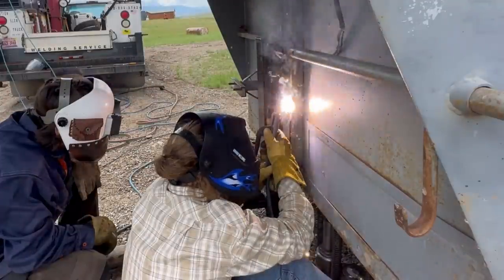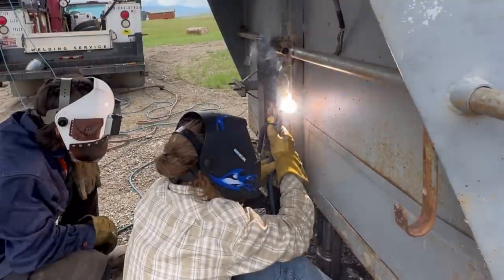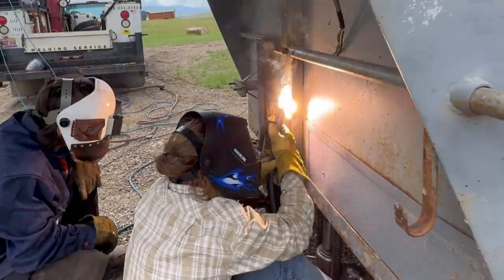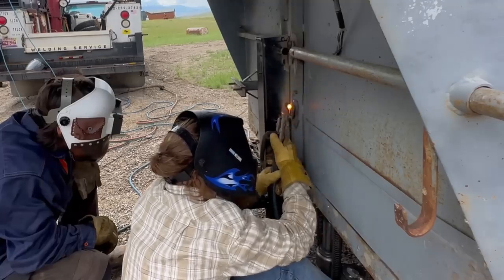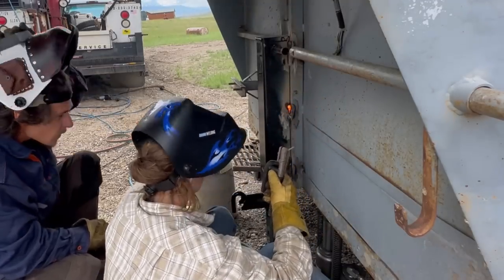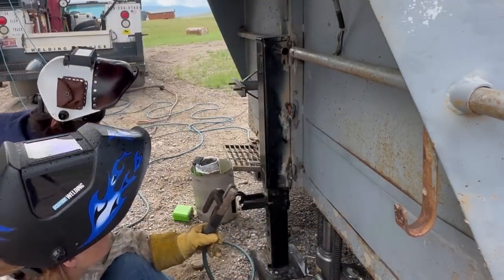Slow down. Slow the arc. There you go. Slow the arc. Make it burn away from your eyes, you know? I think you might have burned through again a little. No, no, you're good. All right, go ahead and knock the slag off.